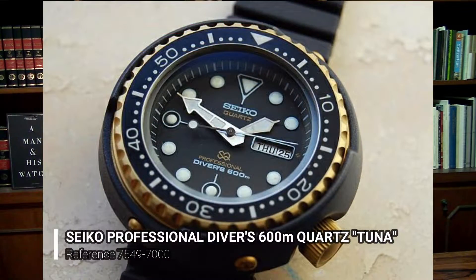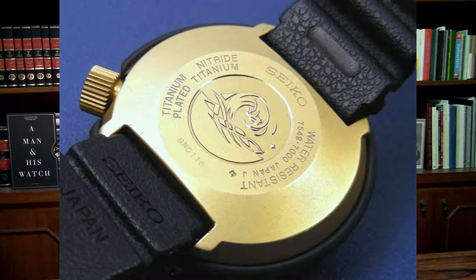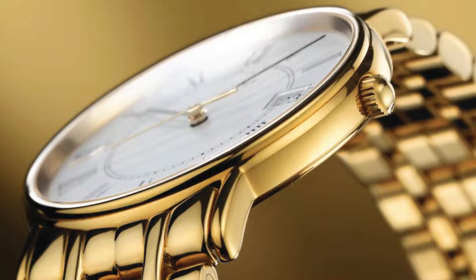Like with electroplating, you can use different layers built up one on top of the other to make the coating more scratch resistant, to promote better adhesion between materials, or to change the color of the coating. For a gold coating, for example, you start by applying a layer of titanium nitride, which also has a gilt appearance — like the classic Seiko Tuna, which has that gilt appearance thanks to a titanium nitride coating. In the PVD process, you apply this titanium nitride layer first to make the surface very scratch resistant, and then apply a very thin layer of gold on top to make it shine.